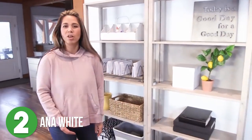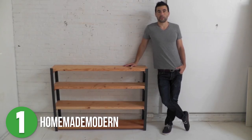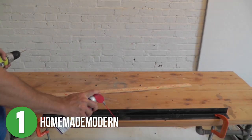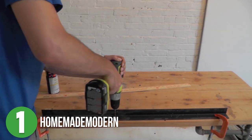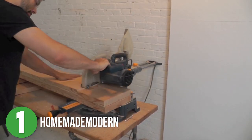If you're looking for a cheap DIY way to make some large shelves in your home, you really need to check out this project. And coming in at number 1 is Homemade Modern with this crazy simple build that looks absolutely amazing. How simple is crazy simple? Look at that! Ben started off with some pre-cut angle iron from his local home improvement store. He measured where the shelves were going to be and then drilled holes into the iron. Next, he took 2x10s and cut them down to 4 foot pieces for the shelves.